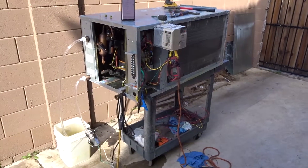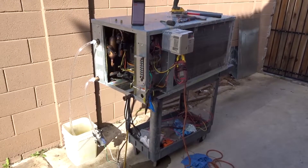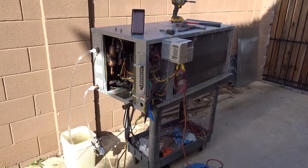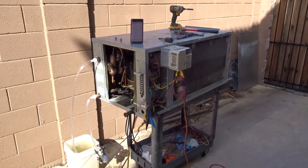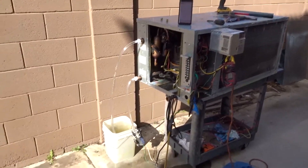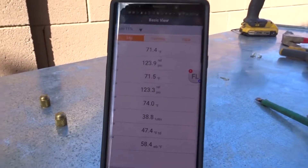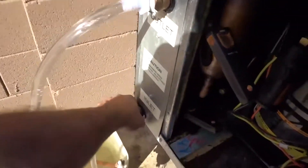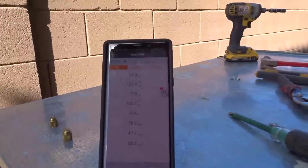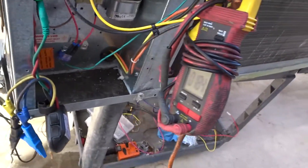What's up guys. I got home a little early so I just hooked this unit up real quick. I'm gonna give it a quick test run — I do have somewhere to be shortly. Water pump is hooked up even though it's dripping a little. Got about 71-degree water, probably about 70 out of the tap. Refrigerant pressures are equalized. Drawing 1.8 amps for the blower.